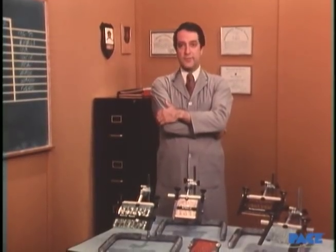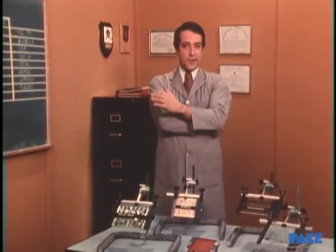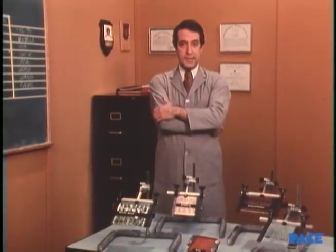Removing a conformal coating is often the first task we're confronted with in the repair process. They're put on for a variety of reasons: for insulation, to protect from corrosion, sometimes to hide what's underneath. Our problem is to remove them as much as necessary to get to the circuitry or components underneath, and we need to do it in a way that won't damage the board or the component. There are several different methods that can be used.